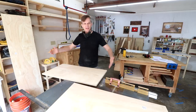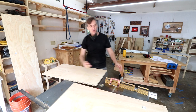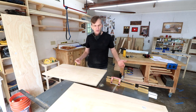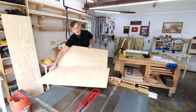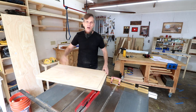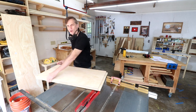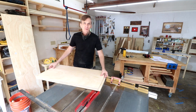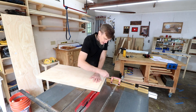The length of these boards fits in a weird place where it's too long to set up my rip fence and almost too wide to use my miter — but I can use it. So the best way for me to do this is to use one board as my actual length reference, and use that to mark a line on all of the other upright pieces. Just make it flush and draw a line.